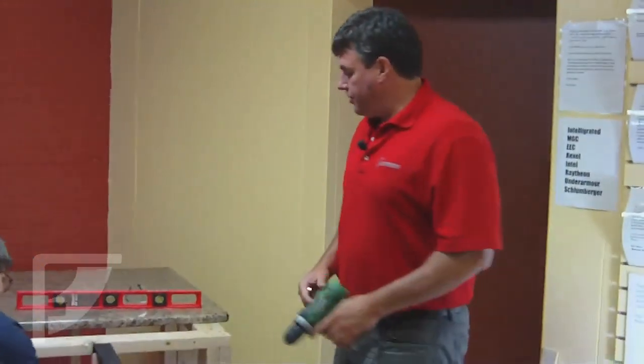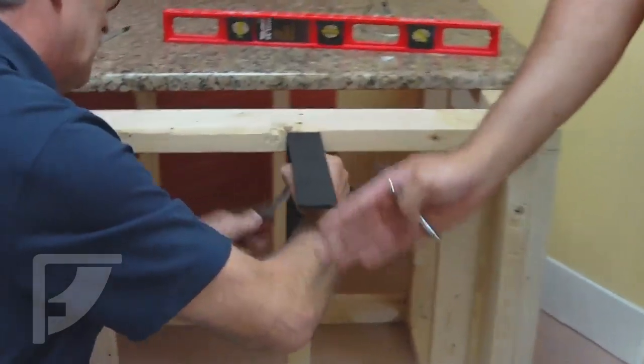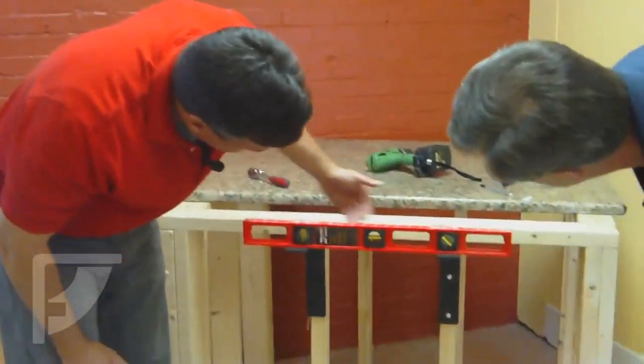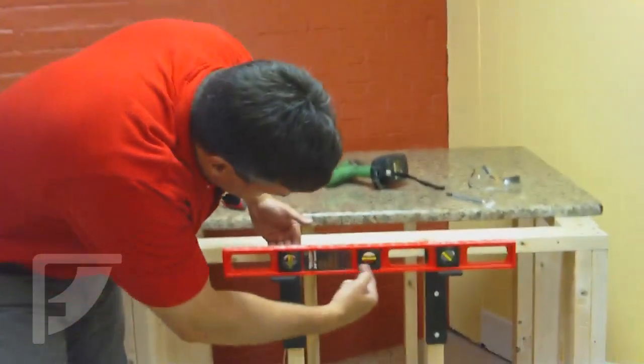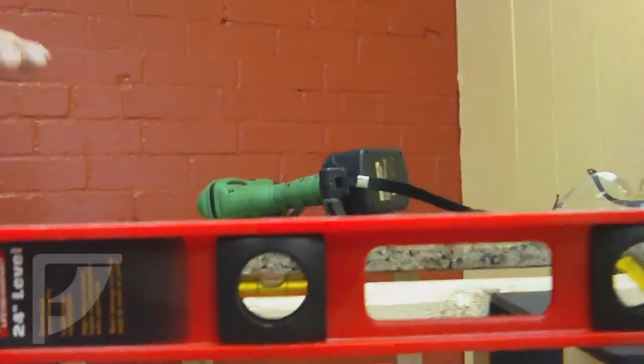While Brock's doing that, let me mention this. This particular bracket is 10 inches — extends out 10 inches. Federal Brace guidelines state that we suggest you do not extend past four inches past the brackets. So this is level from bracket to bracket. You can see that we have the bubble in the middle, which means we have checked level in this plane as well as horizontally between our brackets. So we've got a good level structure that we're starting off with, and we can proceed to add the other brackets and then put our countertop extension on.